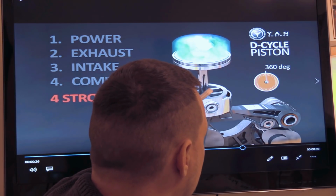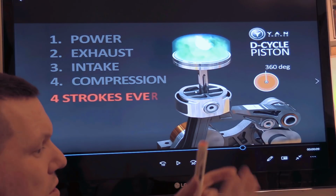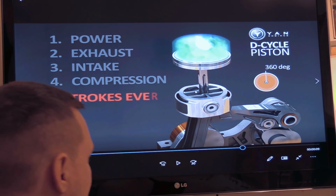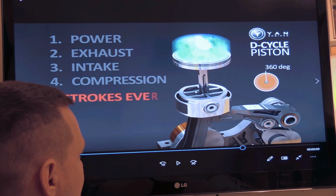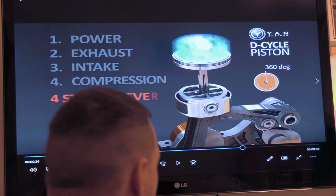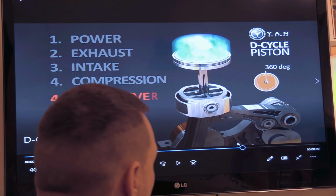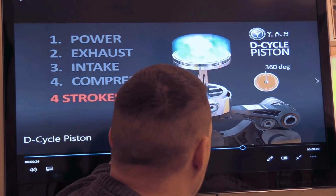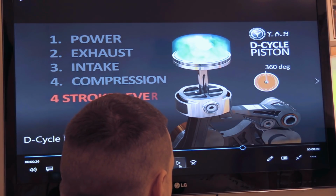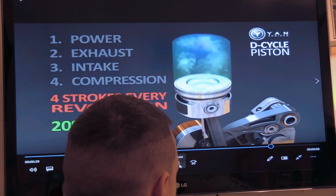You can see that you've got this big slice in here. Basically, it's an elongated hollow for this articulated rod to move within, without clouting anything. You also see that it's hollow. They're trying to make this piston as light as possible. One thing you have to take into consideration is that all the forces that go through this piston have to go through this contact surface. And we just move on in the same thing, rocking up and down, up and down.